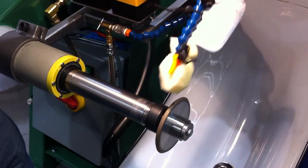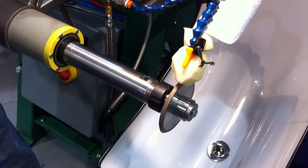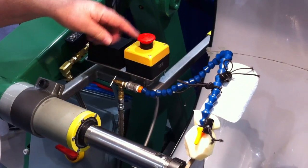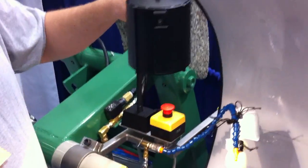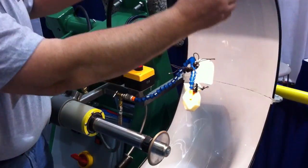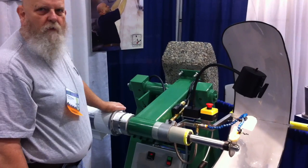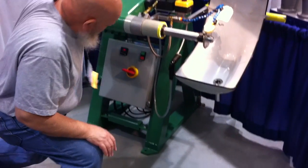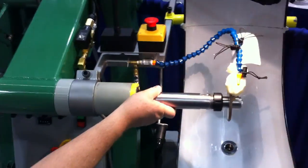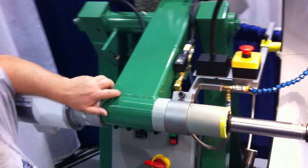Water adjustment is here. We're not hooked up to the water so I'm not going to demonstrate. When you're ready to stop, that turns it off, or you can use the off switch down below — this is much more convenient. It's in the stop position; if you turn it, now it's ready to be turned on again. The Moffat light is also totally waterproof, positionable where you want it so you can see what you're doing. It's got a wonderful counterbalance. The whole thing weighs a little over 800 pounds and is very stable. When it's on an unleveled floor, if you just loosen these two bolts and this bolt, the manufacturer says you can jiggle it and it will cock the legs to make it perfectly stable, then tighten them all back up. You can put it on little rubber pads and it's just not going to move — it's not going to walk out of your shop.